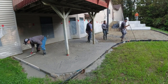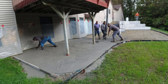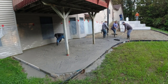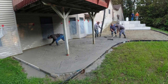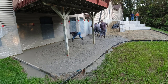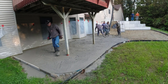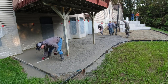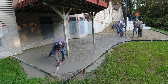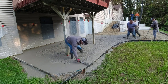We're getting going with the first truck — we've got two trucks coming today. It's about a four to five inch thick patio, we've got rebar in it. We're using our Gator Bar rebar, which is a fiberglass rebar we've been using for a couple years now. We really like it — it's lightweight, strong, and easy to use. Up against the house we glued on what we call foam iso strip, an isolation strip, so the concrete doesn't bond to the house. If the patio slab ever wants to move, we don't want it sticking to the house, otherwise it's just going to break.